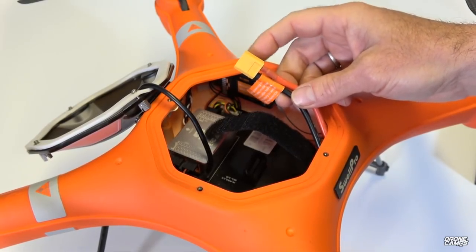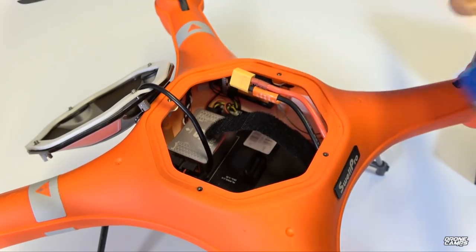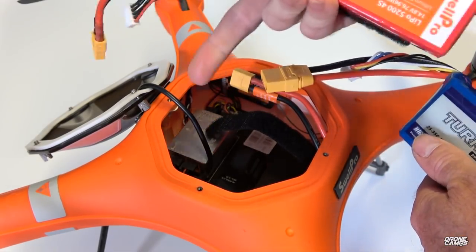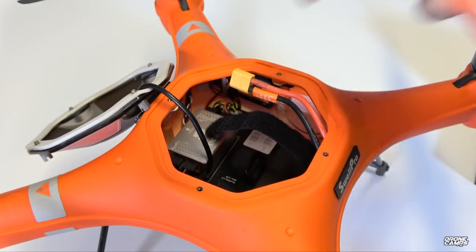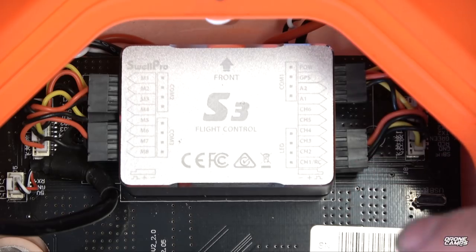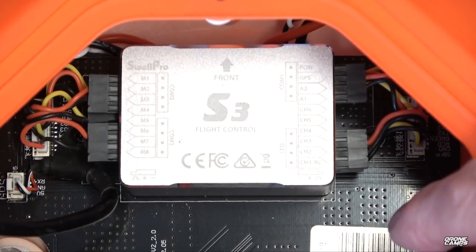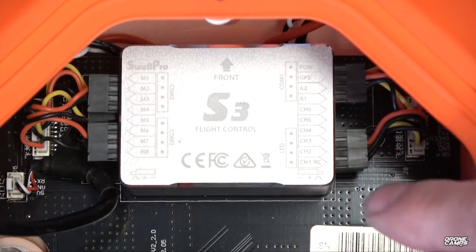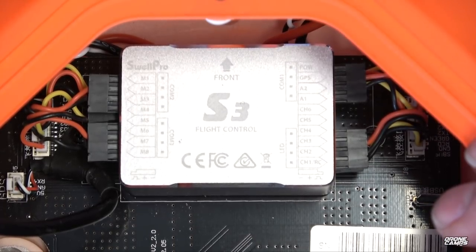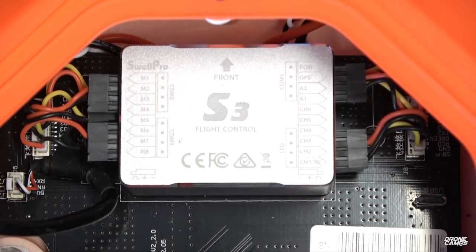If you buy another battery, something like a 4S 5000mAh, you're likely to find one with an XT60. If you get something with a larger XT90 connector, you can use a converter. Looking inside the cockpit at their proprietary S3 flight controller — they did not use DJI Naza, which is sort of a five-year-old technology. They designed their own flight controller with built-in auto stabilization, barometer, and GPS. It has three comm ports, LED control board, and two aux channels for adding extras later.